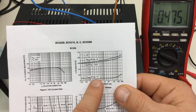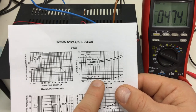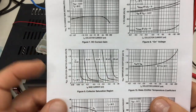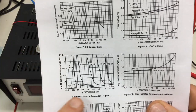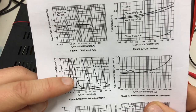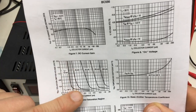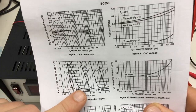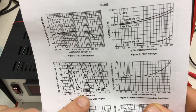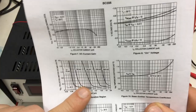with 58 microamps or 0.1 milliamps, so we are more in the region of 200 here, and then these curves apply. So we are here at a collector current of about 20 milliamps, and yeah, you see where the collector emitter voltages are. Officially, we would have to provide that in milliamps, so yeah, we're about here in the curve, so 0.2, 0.3 volts, yeah, right in the knee.